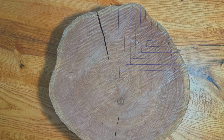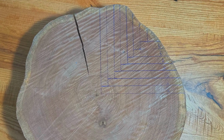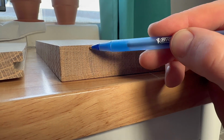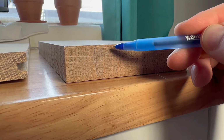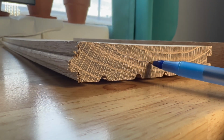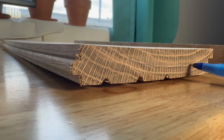If you look closely, all of the grain is running vertically through the face of the board. I know this is hard to see on the end of a log, so let me show you on 2 boards. Notice the grain is up and down on the rift-sawn, and the grain is across or horizontal on the plain sawn. The log has to be at special angles to the blade to get rift-sawn lumber. It's awkward, it's labor intensive, and it results in a lot of waste to produce the finished product. That is why rift-sawn is so expensive.